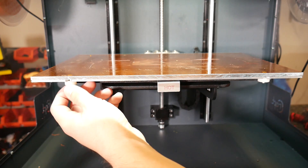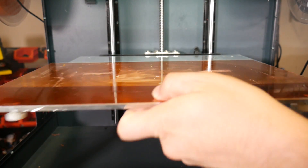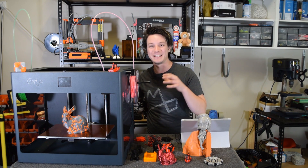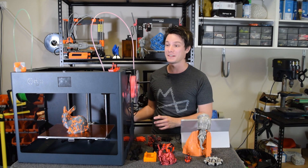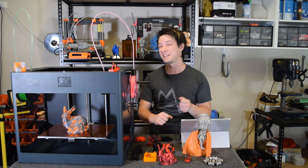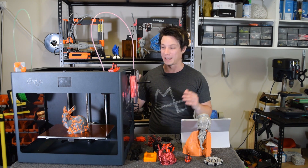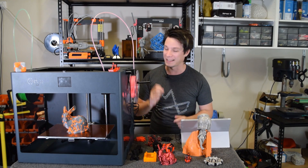The bed is a super thick and sturdy aluminium plate, and you can simply loosen two wheels at the front to slide it right off, just like the CraftBot Plus. I loved that feature back then and I love it now. I still think removable print beds is a must for 3D printers, especially ones this large. When you get prints off the bed, sometimes you need to use a bit of force, and you're not going to risk unlevelling it and throwing the machine out of calibration.